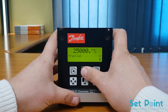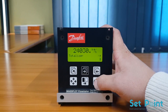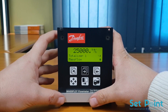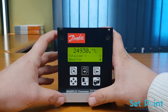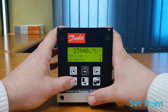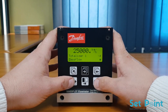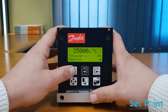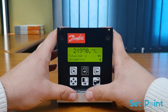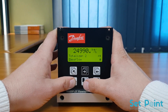The next parameter is for sensor temperature. After that, press the top-up key then the forward key — the next parameter will be Totalizer. There are two independent totalizers. Press the lock/unlock key to access Totalizer 1, then press it a second time to edit the settings. To select the function of Totalizer 1, press the lock/unlock key then the change key, and select the requested function — mass flow or volume flow — then press lock/unlock to save. To access Totalizer 2, press the top-up key, then the forward key, then the lock/unlock key, and select the requested function as done for Totalizer 1.